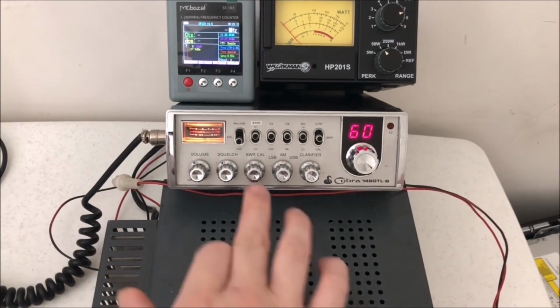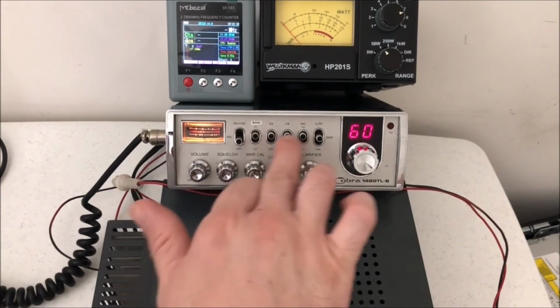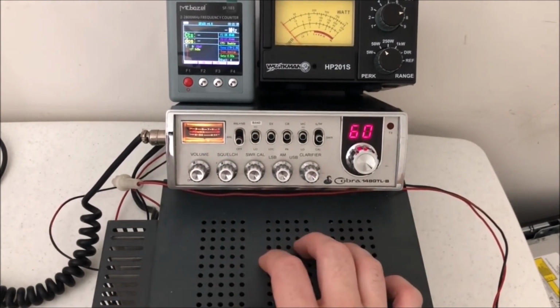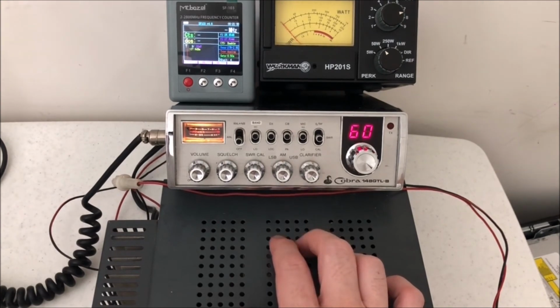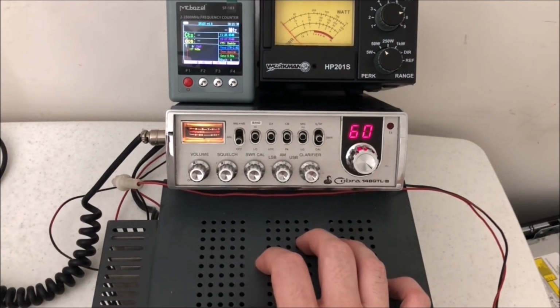So what I'm gonna do is, I know that thing got repurposed, so the tone control is probably either tied low or tied high, and let me see what's going on inside this radio and see how bad the work is. What I think is in here is 1969s. I think that's the finals in these, is the 1969. So we'll see what kind of coolness this thing is inside it, but we'll be back.